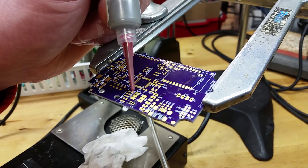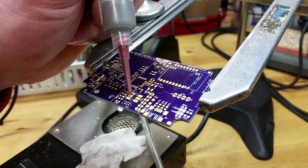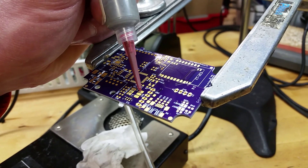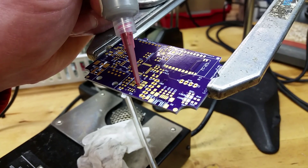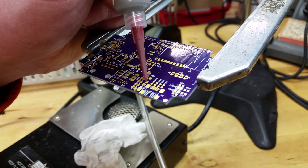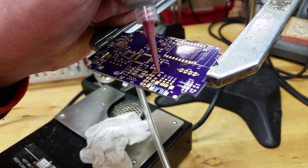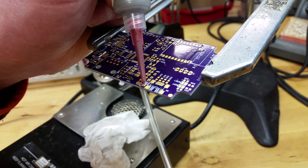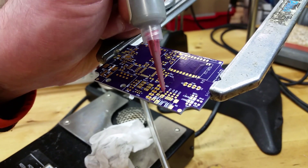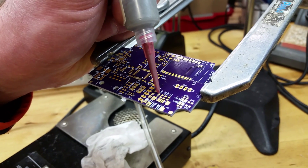Make sure you put the tip on the pad so it's touching the pad, and that will force the solder paste to stick to the pad. You just go from pad to pad and you can bang out a prototype circuit board fairly quickly. Again, if you don't have a stencil, this is good enough. All right, thanks a lot.